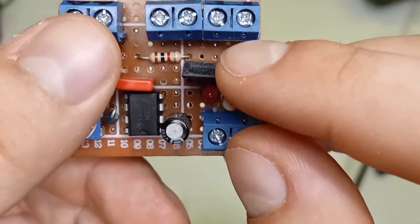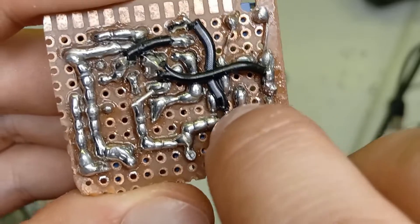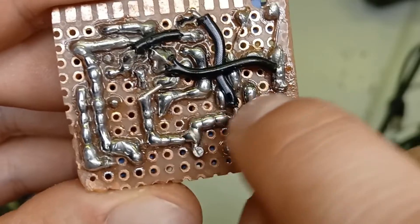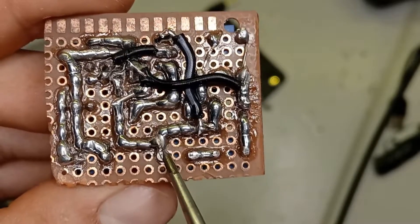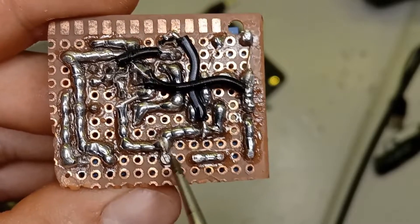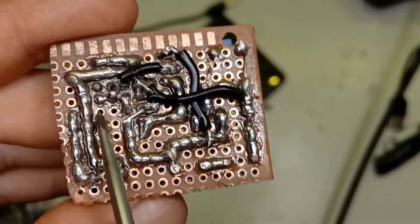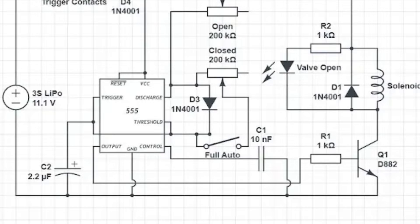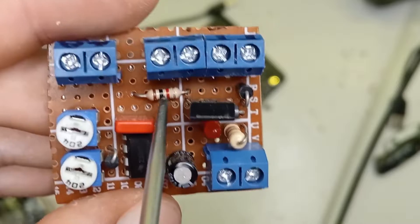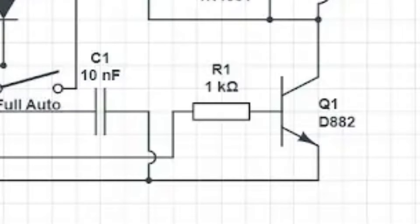The collector goes straight onto the cathode side of the diode. The far right pin of the transistor is the emitter and this has to go to the battery negative. If we flip it over you can see I formed a solder track to the negative connection — this little negative track here is another common connection. It's a bit fiddly joining the little pads together to form tracks; you want to work out the path first, put a blob of solder on each track, and then quickly bridge between the pads. That's how I get these nice little tracks. Where a track needs to jump over another one I use insulated wires. So now we have the negative side of the transistor connected to the negative of the circuit. Then we connect our remaining 1k resistor to the base — the far left pin — which is the connection that actually tells the transistor to turn on.